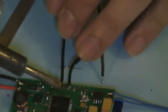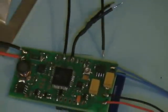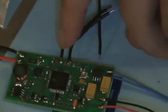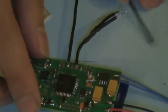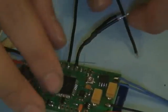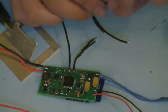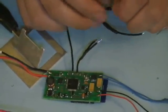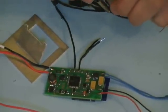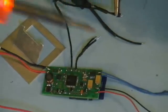This connection is for the aux switch. To help with pin layout: think about using pins one, three, and five. Going from the on/off lead as solder point one, three is ground, and five is auxiliary. Something that can be really frustrating, if you don't have experience, is thinking of everything all at once — batteries, motor, switches. That's not how you want to approach it. Tackle one thing at a time; right now we're focusing on the switches.